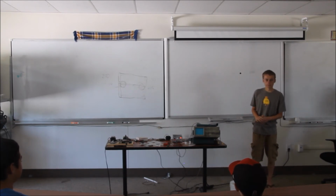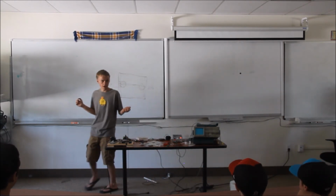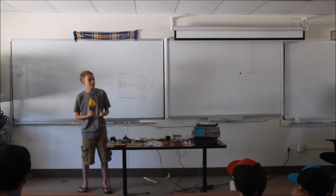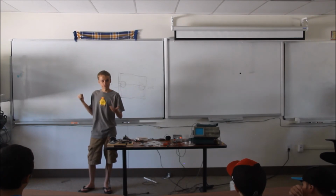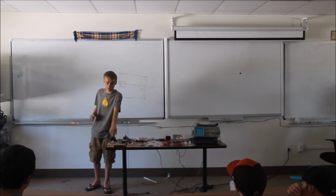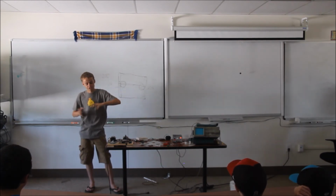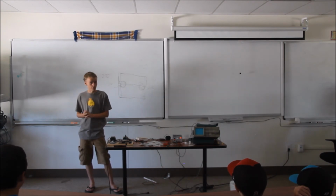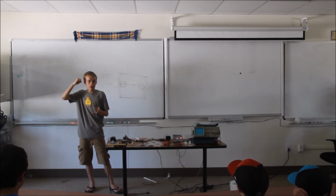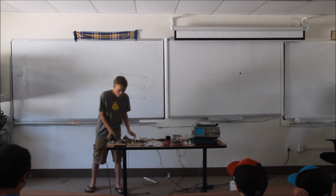Yeah. Well, pretty much what those do is they step down the high voltage that comes from the big power lines into a slightly lower voltage. So, believe it or not, the voltage flowing through those big power lines in the desert and stuff, 115,000 volts. That's like 4 times as much as this power supply, so that's a lot. Now those get stepped down in those big power conversion stations that you see into 2,000 volts, which goes in the power lines that go around our city. Those get stepped down at your house to 110 volts that you use in all your walls.